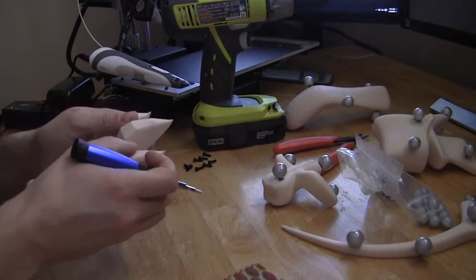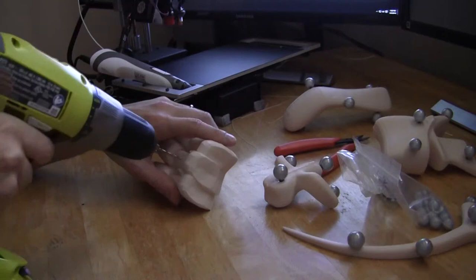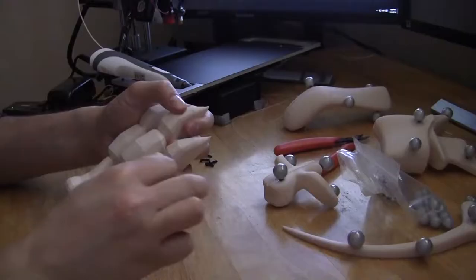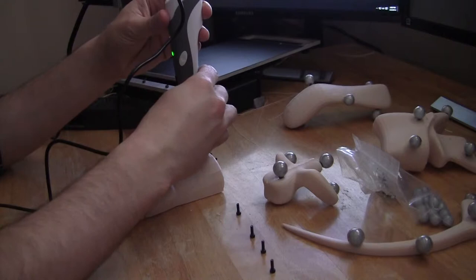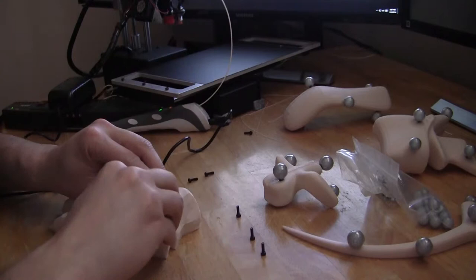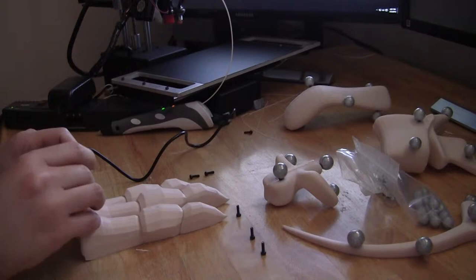The final check is just to move your hands all over the model and make sure there's nothing particularly rough. After that, we took a drill to it and drilled a few different holes where we're actually going to place the screws. The holes are smaller than the screw because we're not actually going to use this to insert the screw directly. Instead, we insert one of the 3D printing pens into the hole — the nozzle gets hot enough to melt the PLA — extrude a lot of material in there to give it a nice base, and then push the M2 screw directly in. Because it's still very hot, the screw will cause a natural depression, perfect for then using the 3D pen to completely seal up the outside, trapping the screw inside. You've got to be very careful — the screw is incredibly hot as well, it really conducts a lot of heat — and then just wait for it to cool down.